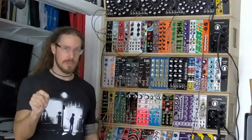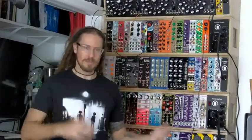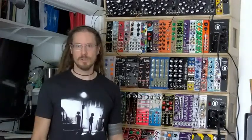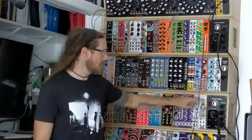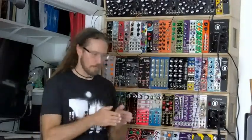Don't do that. Never do that. Again, my audiovisual mind told me that was the right way to do it, but people who know more than I do about electronics said, no, you always want to do radial distribution. Radial distribution means instead of jumpering from 1 to 2 to 3 to 4, I'm taking a point on that output and I'm splitting it four ways.